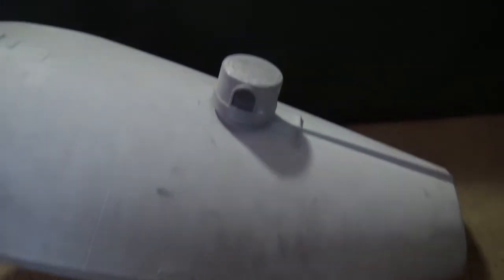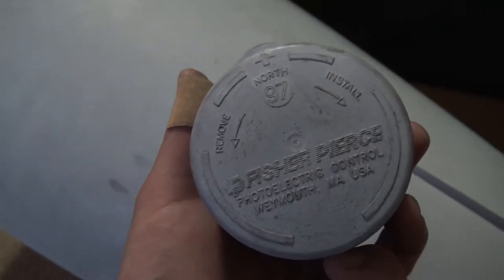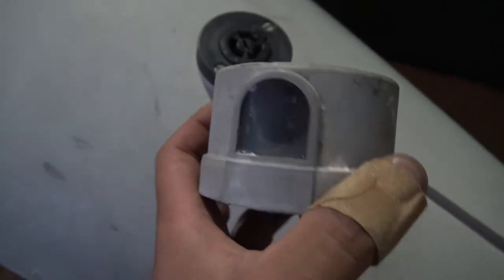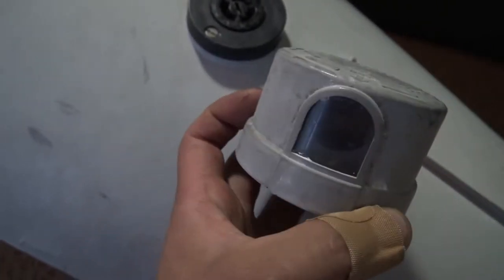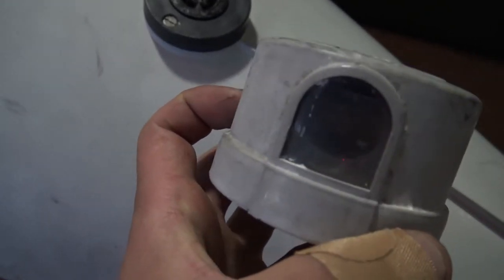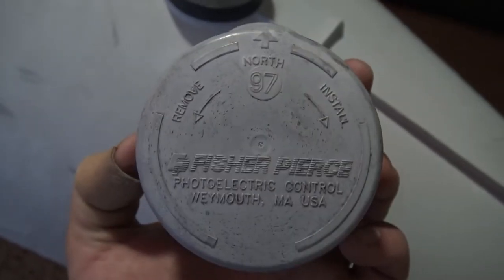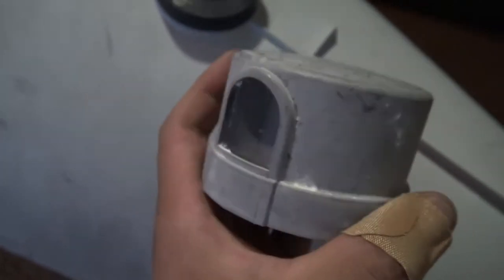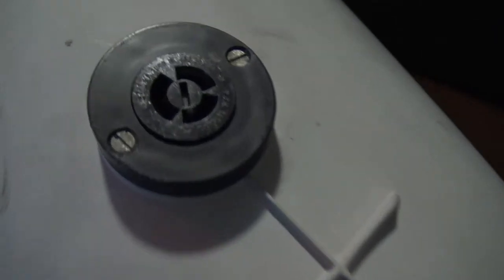Other than that, the outside is pretty simple — there's not really a lot more to see. Going up to our photocell socket here, you can see the photocell. This came with the fixture and is from 1997 — definitely the original photocell. I think it dayburns. I haven't really run this photocell much, but I think it's a dayburner. I'll have to check. But I actually know how to open these up and replace the photoeye, which is probably the part that went bad. It's pretty much just a simple Fisher-Pierce photocell. I've gotten a lot of these from Detroit on abandoned area light fixtures.